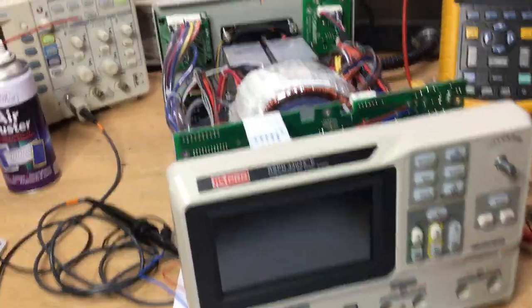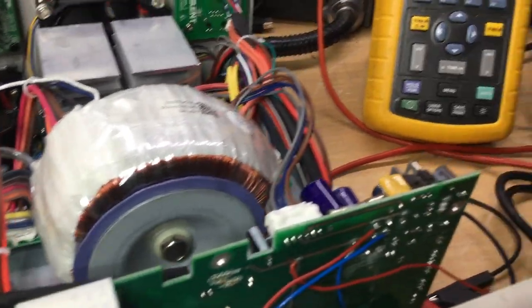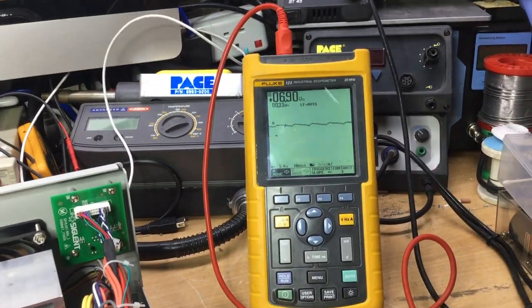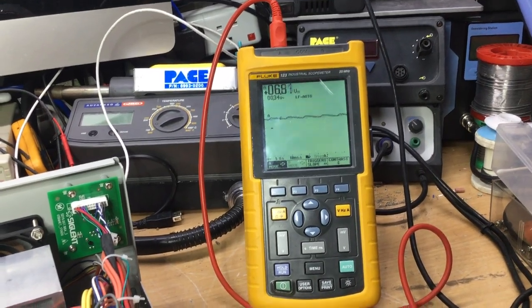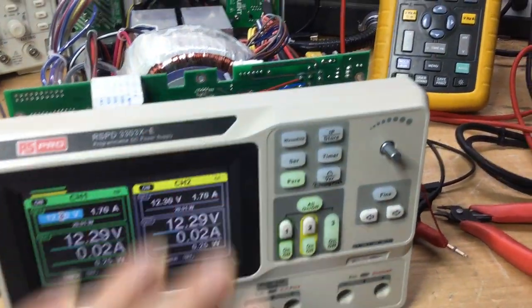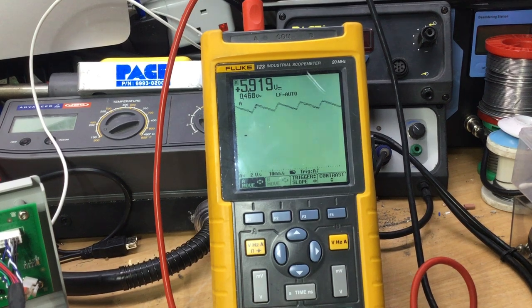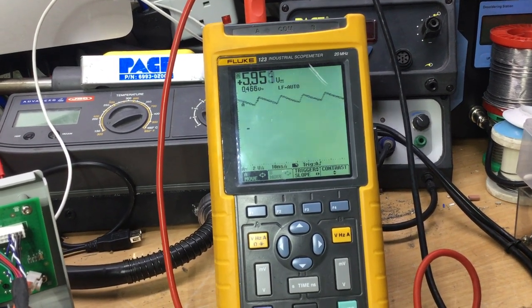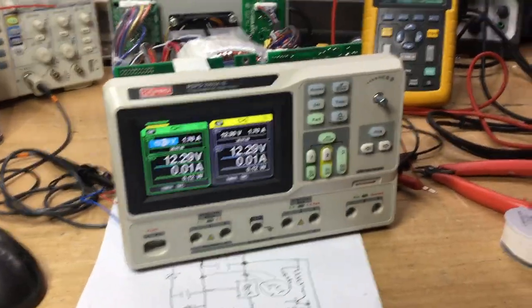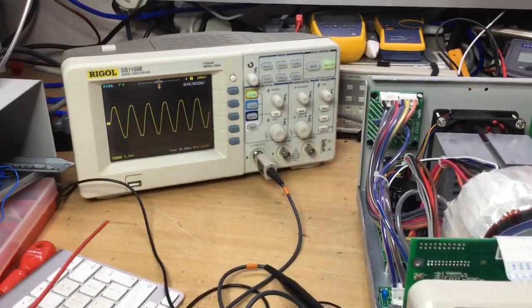Okay, so I've left it switched off a while now, just to acclimatise back to room temperature again. We'll just reconnect the IEC lead at the back. So, right, we've got it coming back up, and the voltage at the moment is reading 6.85 volts. Now, if we flick it into parallel, I think it is, and then all outputs on, we can see that it'll start to decline, and we can see it's getting loaded there because it's having to regulate the supply that it's giving, but it'll start to go shortly.